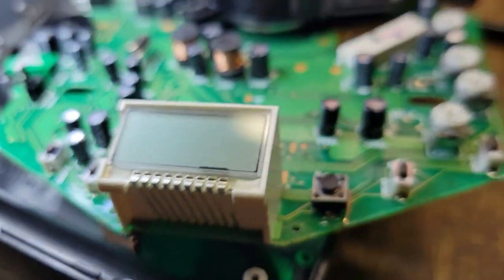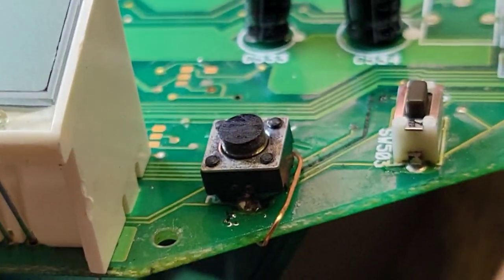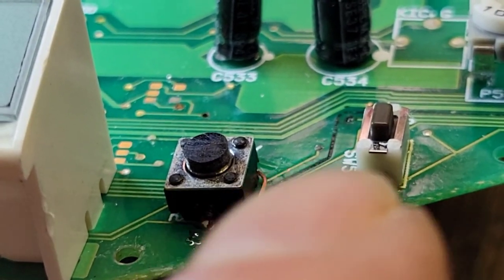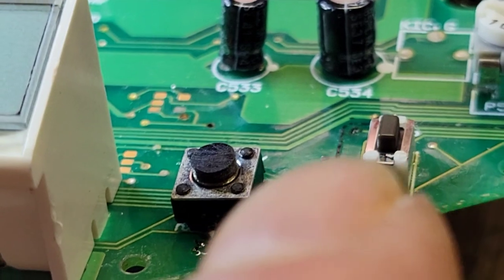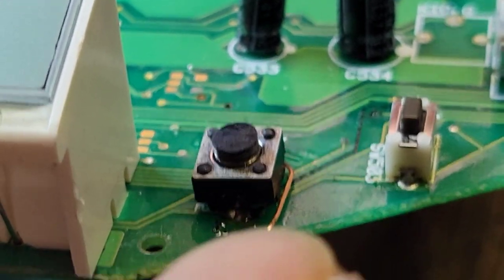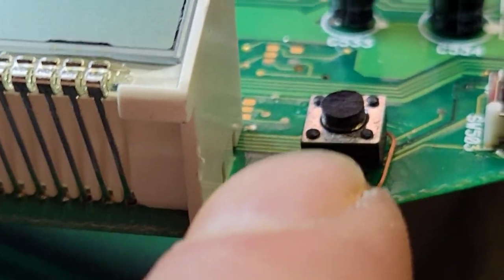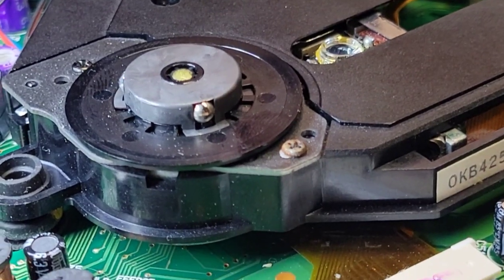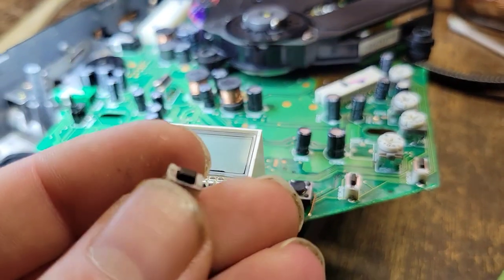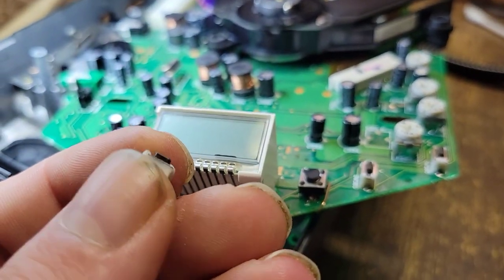I'm going to get these wires all soldered back together and get this connector all cleaned up. Red is on the right and negative is on the left. Get that all straightened up, clean all this out, then put it back together and end the video for this section before moving on to the next one. I noticed on this area that there were really bad traces — and this button was completely dead. This is the play button — well, the original one is here, but it was completely rotted out from all the damage.